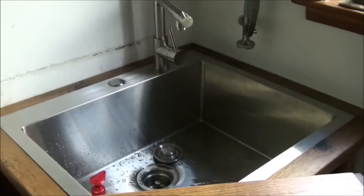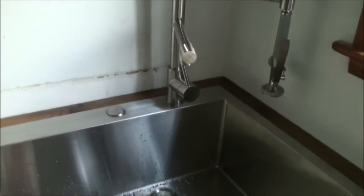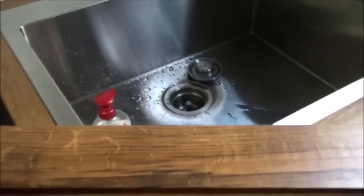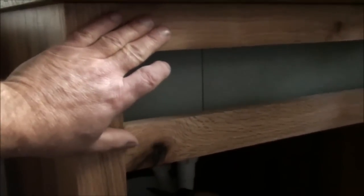Now we're going to be putting the finishing touches on the cabinet, now that I have it installed in the bathroom. It's all plumbed in and it works — we've been using it a little bit. I've got backsplashes to put on, the toe board to put on, the doors to put on, and this little decorative piece that goes on the front. I've cut a little piece of wood — four and a quarter inches — because I want the bottoms of the doors to be level and square at four and a half inches.